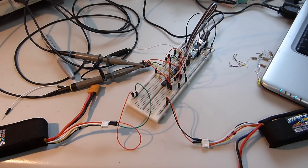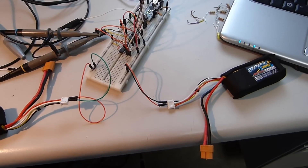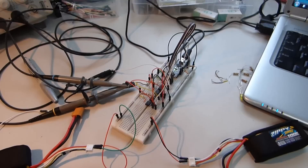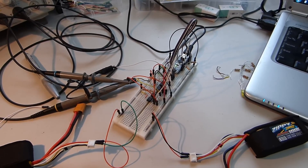We are monitoring voltages only through some isolated ADCs — analog to digital converters. In this test I have two separate batteries, and these two batteries are isolated and they are sending an isolated signal to an Arduino Nano.